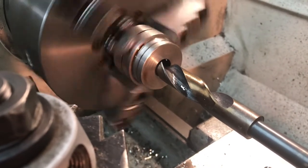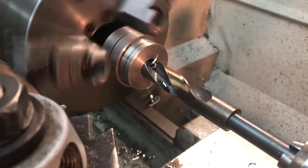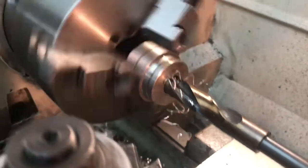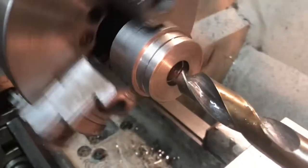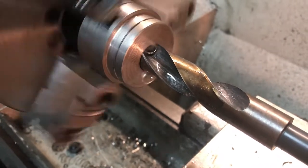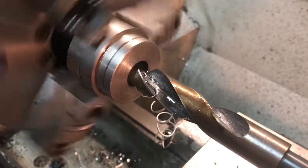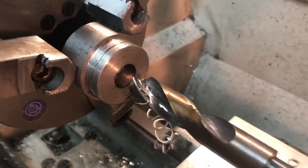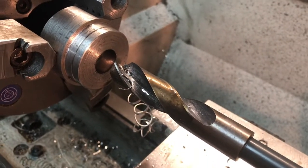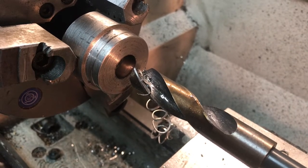We are drilling. I've got a set of large drill bits that go all the way up to an inch. I actually have two sets — one is a silver and deming set I use for soft metals, and then this other set here that's titanium nitride coated, which I got off eBay years ago. It works pretty well. This material is stainless steel — I confirmed it by trying to pick up the swarf with a magnet and it wouldn't pick up. It's a pretty hard grade of stainless, but it's cutting pretty clean. I've got the lathe set at 70 RPM; I'll keep making progressively larger cuts until I've drilled to one inch, then use the boring bar to get it out to an inch and a quarter.